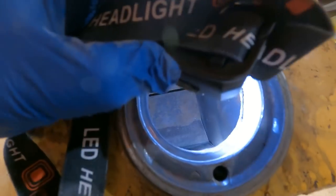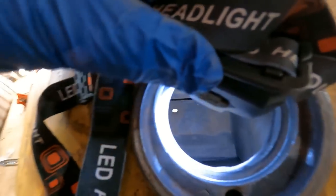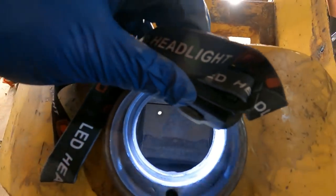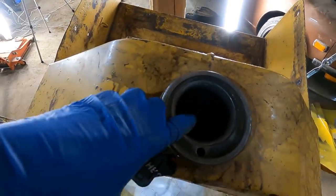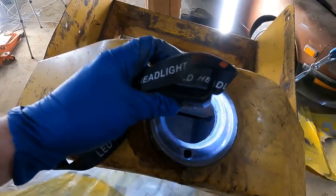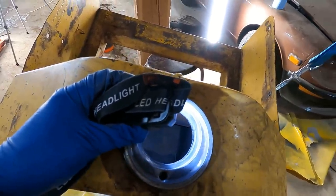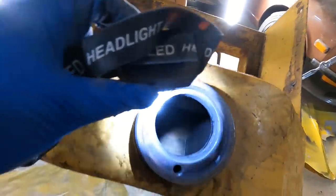Also the issue here is the space under the baffle is less than a quarter of an inch maybe. It's really tight in there. Gravel wouldn't go in there. So if there was bad rust scale, what I would do is pour a bunch of lock washers or split washers in here. They have a nice sharp edge and they'll fit under the baffles, and then you could vibrate them out on the tractor wheel or some other thing to get them to rotate around in there.